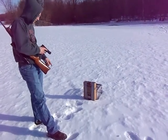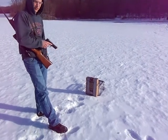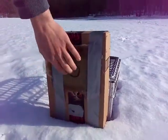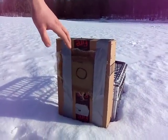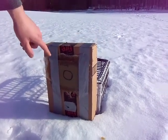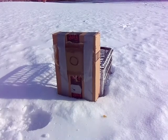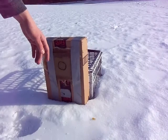Testing a bulletproof plate prototype. It's obviously not the size of my chest — it's about 5x5. There are 21 layers of fiberglass woven roving, I think 18 ounces per square yard, maybe 24. It's woven roving fiberglass resin, compressed, with a 1/16-inch steel plate on the back, with just one layer of fiberglass around it to keep it bonded.